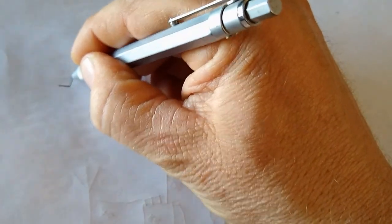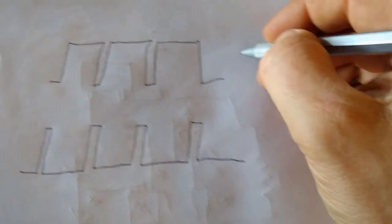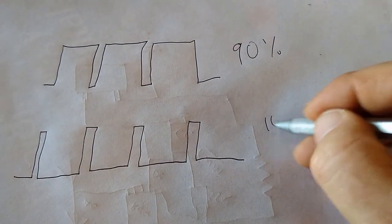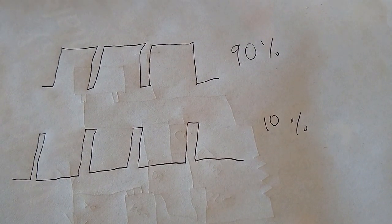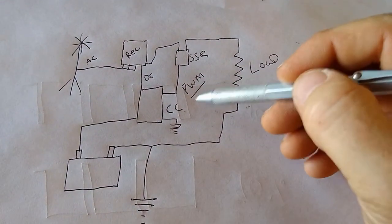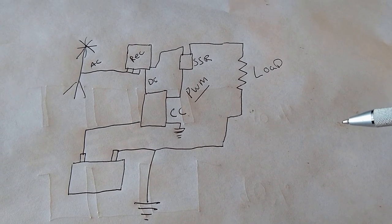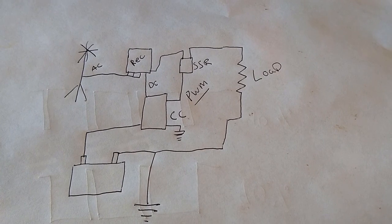We can visualize that with another little speed drawing. The top one is sort of 90% — almost all the way on — and it can be all the way on, all the way off, or most anywhere in between. The bottom might be 10%. It just varies the on time by varying the width of that pulse, which allows it to act more like a dimmer switch than an on/off and gradually offload that power rather than all at once, which can be a little less friendly to the turbine and the rest of the equipment.